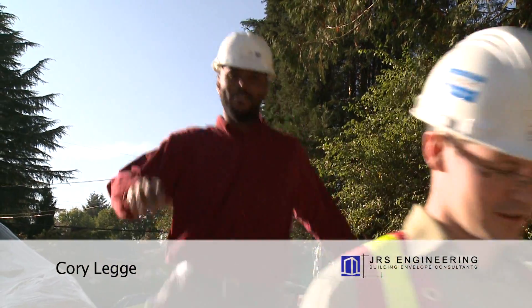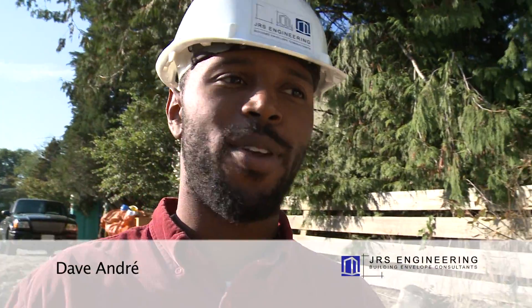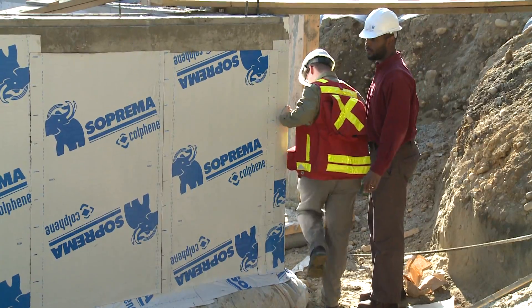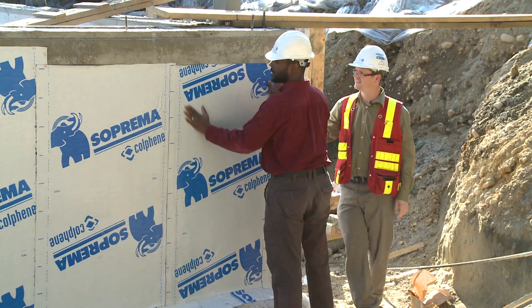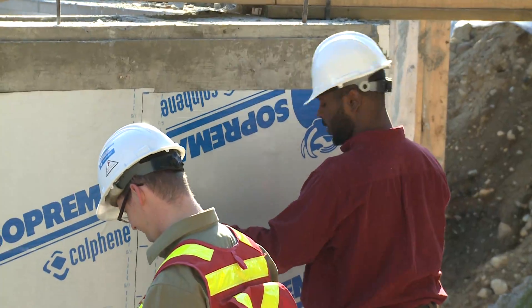Hi, I'm Cory. Hi, I'm Dave. We're both here to look at the waterproofing today. When we first walk on site, we're thinking about what is it here that I've come to review, and what are some of the ways that people go wrong installing certain products. We're thinking ahead of how things are going to come together, making sure the basement walls are going to integrate properly with the walls above — assisting the contractor to make a watertight house that performs consistently with the owner's expectations regarding water, comfort, and heat loss. We were here to review the waterproofing membrane on top of the ICF. We knew the specifications and the tricky areas, and it looks like they're doing a good job with just some minor things that need to be slightly adjusted.